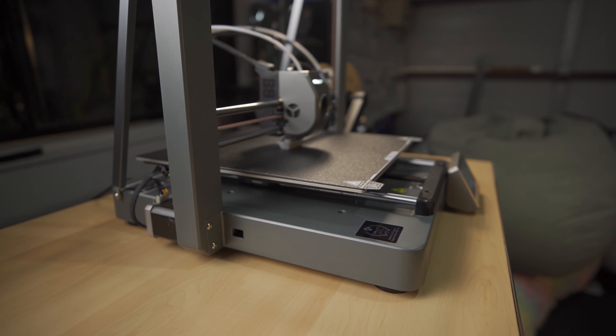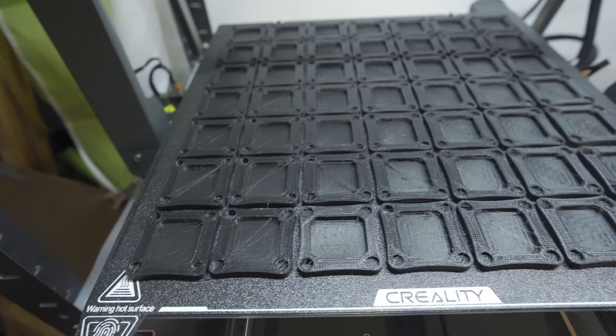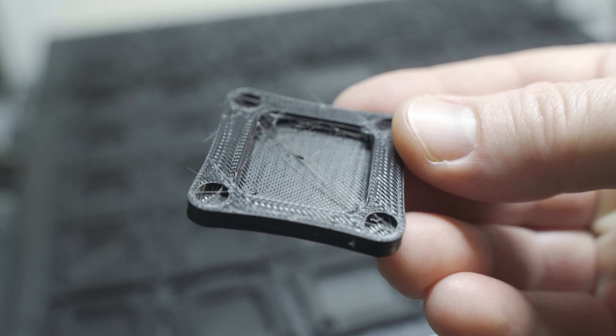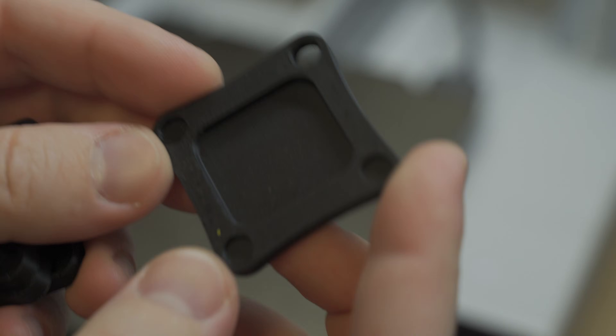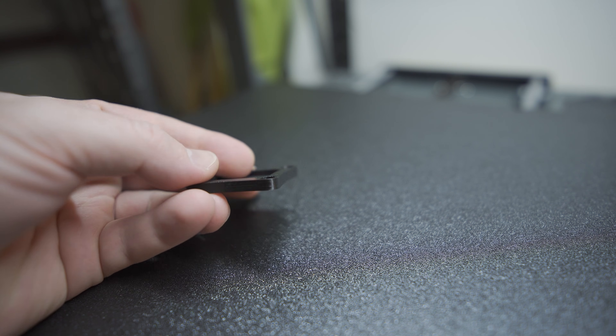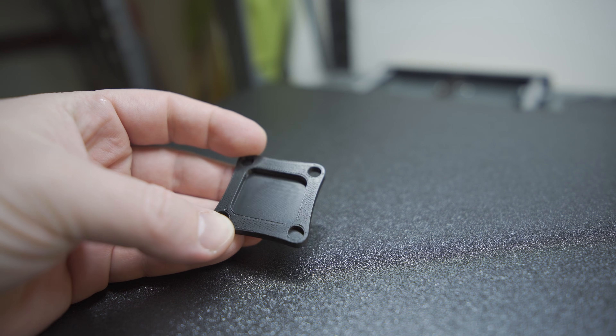Now onto the print results. One of the good things about this printer is it's really fast — we have certainly come a long way comparing it to the Ender 3 V2 I used to own. The quality has been reasonable, and I'm sure with some fine-tuning of settings I could get better results. I was excited to use the larger build volume to print out a large plate of some keychain designs I have, but the end result had a lot of stringing, blobbing, and signs of under-extrusion, meaning the whole print was binned due to quality issues. This may have been due to moisture in the filament, so I decided to test by loading the filament on my Bambu A1 Mini, and the result was perfect. I then dried the filament first and also copied the PLA settings from Bambu Studio over to the Creality Print slicer, and this time the results were better. I think with some playing around with the settings I could get better results, but I'm a bit annoyed that it takes this extra effort. When using my other printer I don't have to do anything and get the results I want first time, but with the Ender I have to spend time fine-tuning things. If the goal is to be a beginner-level printer, it needs to be streamlined in this area to match up to the competition.